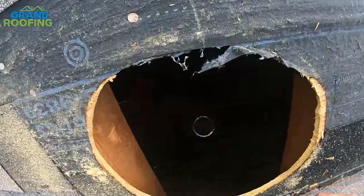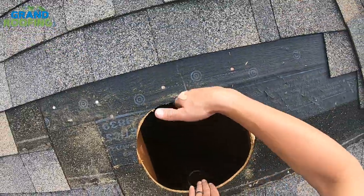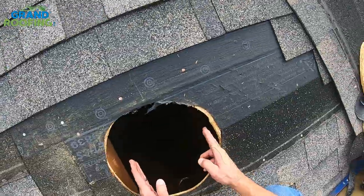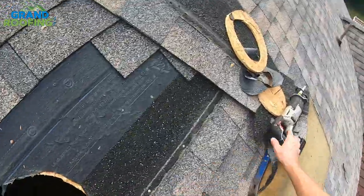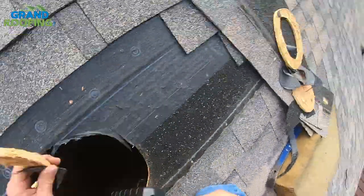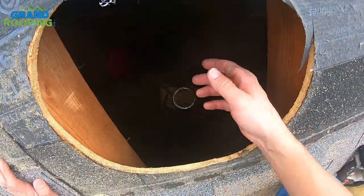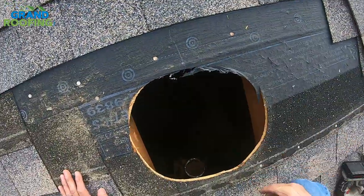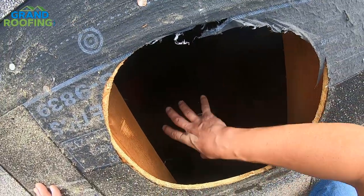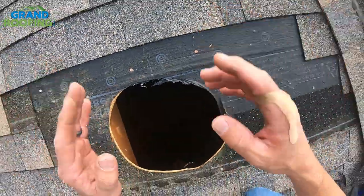We'll get a section of pipe ready to go and see how it fits through here — see if we need to go up higher or lower, or possibly a little more over here, because if you want a clearance of about two inches, you need to trim a little more right here. Let's go get back into the attic and shove that pipe through and connect it. I think that next section of pipe will put me about right here — a joint will be right in the attic and then we'll come through the roof.